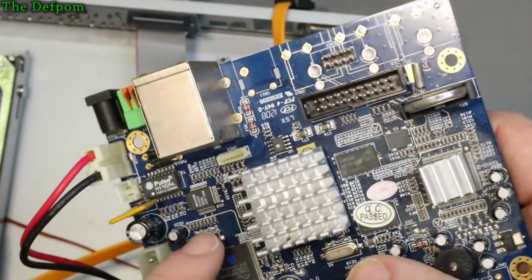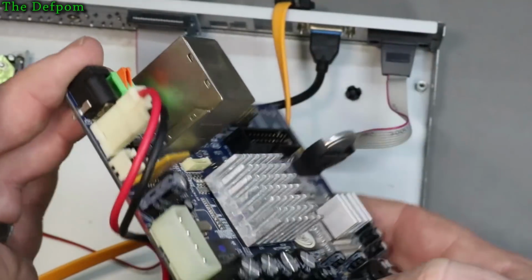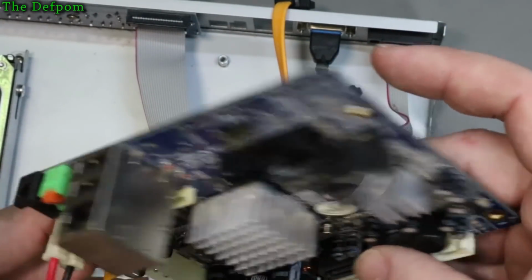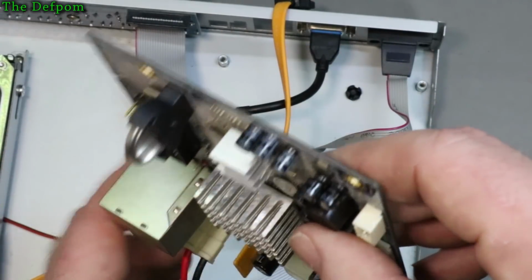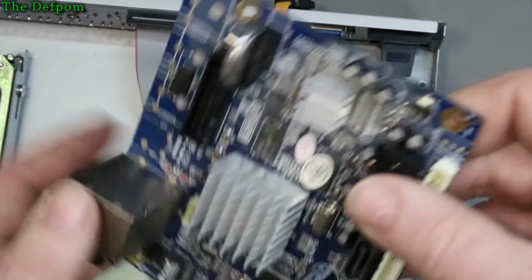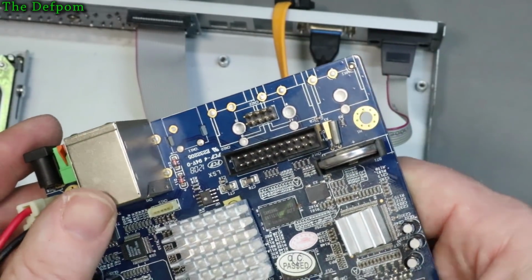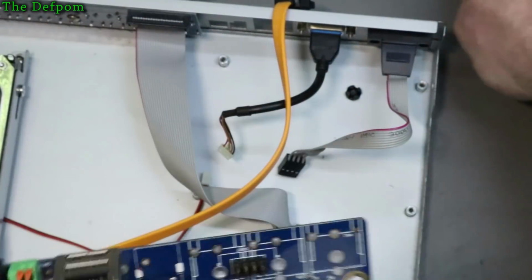There's a crystal there. I suppose I can try and check that crystal frequency, and this one here as well. Side view of the caps. Yeah, they look alright. Some unknown brand, I don't know what they are. And none of the caps seem to have extruded. Sometimes when they blow, the top might be okay, but the actual casing extrudes off the bottom. But that's not happened. So we'll plug power in again, with nothing else connected, and we'll see if it beeps. There's a little buzzer there.